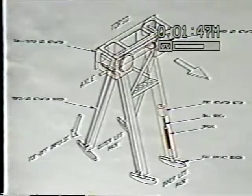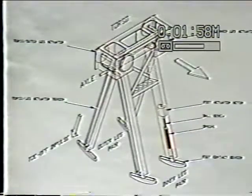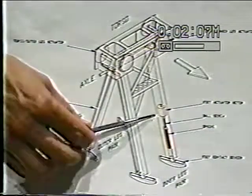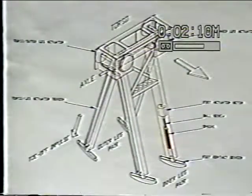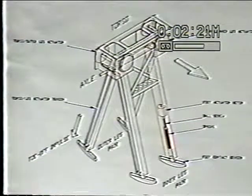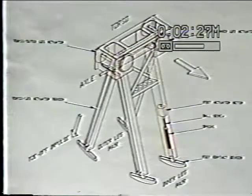Now you've seen a lot of downhill walking, and that raises the obvious question: what about going uphill? This machine should provide the answer — we're building it now and hope to have it ready by the end of 1990. Its dynamics are essentially the same as our original straight-legged machine, but each of the legs has a spring-loaded foot. The idea is to wind up the spring during the stance phase and then release it just as the foot leaves the ground, providing a push analogous to plantarflexion in a human. The more energy stored in the spring, the faster you go or the steeper you climb.